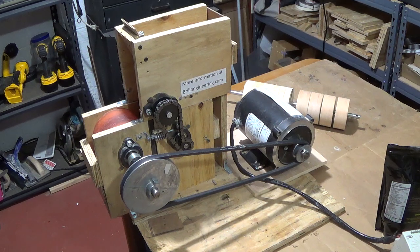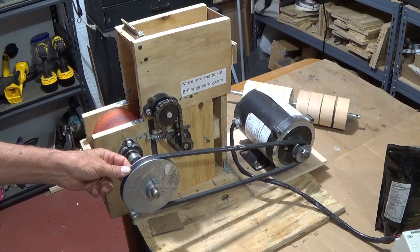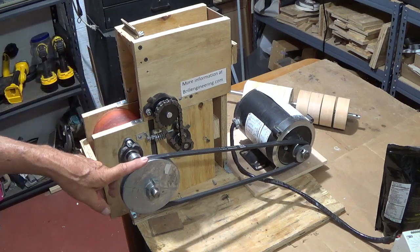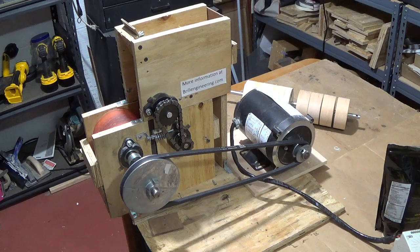We've taken our human-powered pinch rollers for husking rice and added a motor to it. What we want to let you know is you need to keep the speed here at 300 RPM or less. The chain mechanism can't handle going any faster than that. You could still do 60 pounds an hour. We're using a quarter horsepower DC motor.